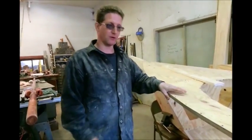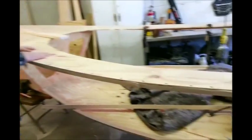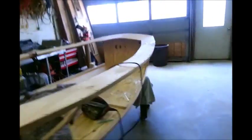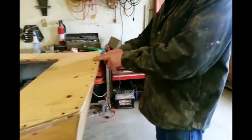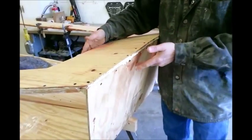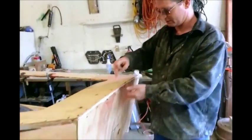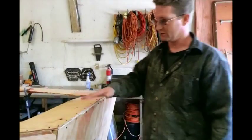Since the last segment, what we've done is we took the top that we had glued up and laid it on the base. It's glued and screwed along the forward bulkhead, the notch at the top of the stem, and at the transom with those curves. We got our glue on there, started screwing at the middle after we lined up the centers, using a clamp to pull down and pull each side — it curves this way too. We would pull them together and do one side and then the other, so it pulled equally and just worked our way out. Left the clamps on for several days to give the plywood time to get used to the curve before we released it.